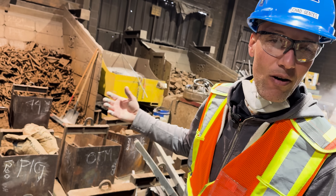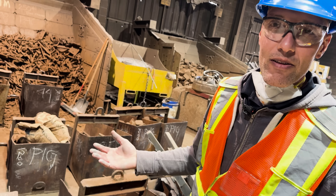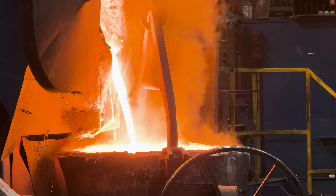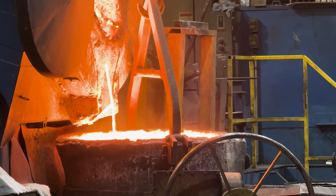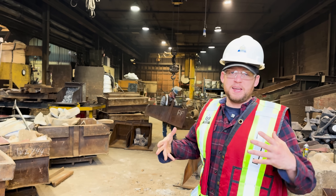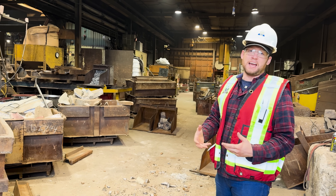Here's an example of a recipe for ductile iron. Our furnaces are 5,000 pounds, so we have all this weighed out by weight percent — you can see 1,500 pounds of pig iron, the other track material — the total weight is about 5,000 pounds, all weighed on the scale. Once we make up the recipe it gets loaded up onto the melt deck, the raw materials go into the furnace, they're melted, transferred to a ladle, and from the ladle it goes out to the mold and gets poured. Everything here is being recycled — old railway ties, old steel parts coming in, melted down and made into something new.